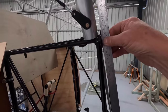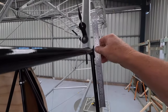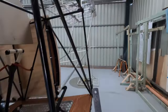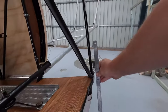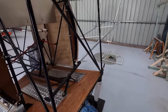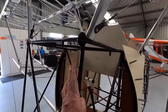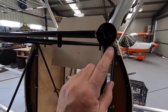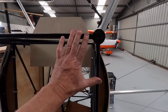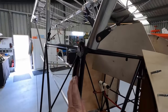The firewall goes on to these footings, which are all over the shop to be honest. That one's out, that one's in, that one's way out. They could be anywhere - one out of four, that's pretty good for this kit. A bit of plywood in there may help - scallop the corners out and then put the firewall on. The whole idea of a firewall was to stop the fire if there happened to be one, and the heat and oil. So I could put a bit of ply on there - we'll work up to that, see what happens.